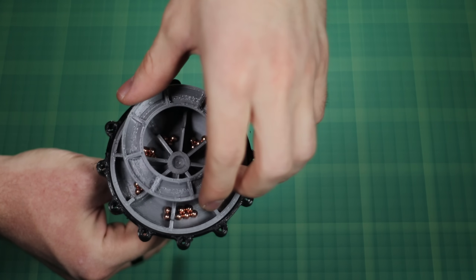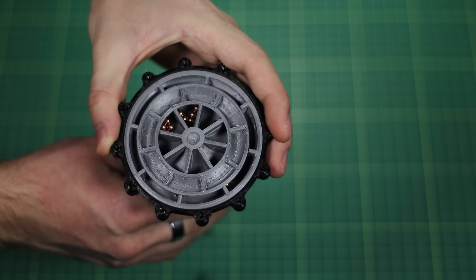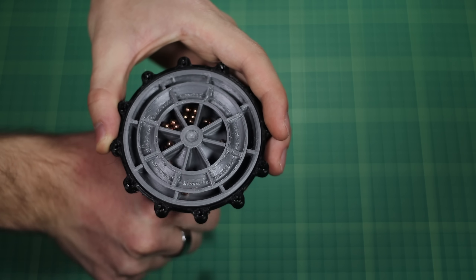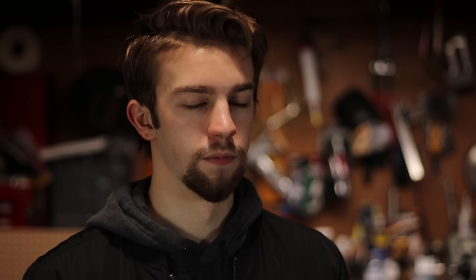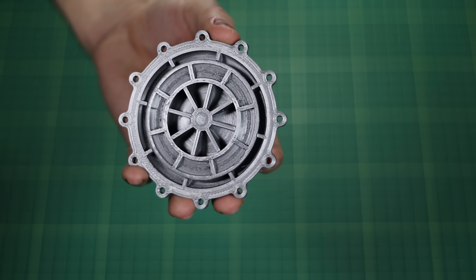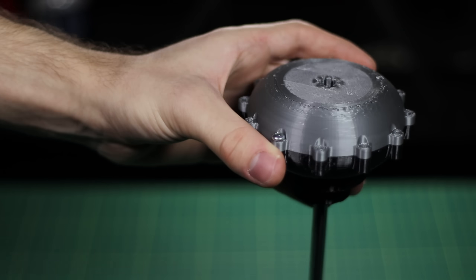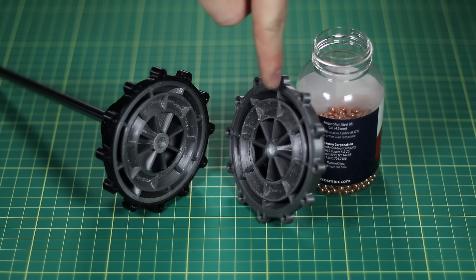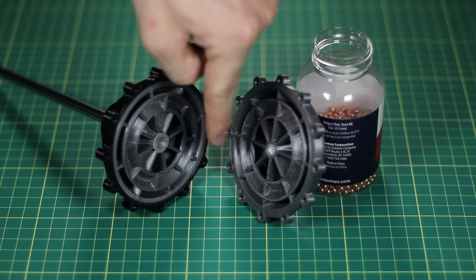When you watch me install this centerpiece — that's called the core — you can see that as it spins around, it moves out from the center, and it wants to move up in between the core and the outer edge. This is useful, because if I install another piece on the other side that mates to the back housing, now because the core is in the way, once it reaches the outer edge of the impeller, it'll actually come up and around, and then back down through the middle, and then make its way back down into the pump again, and repeat the cycle.